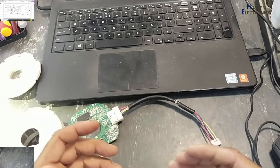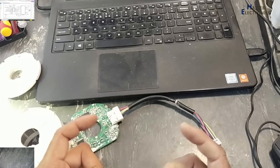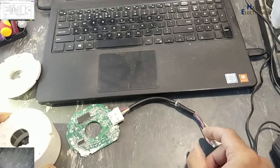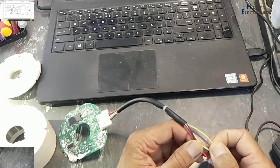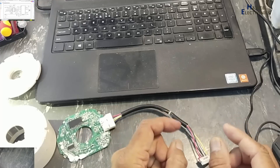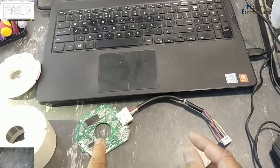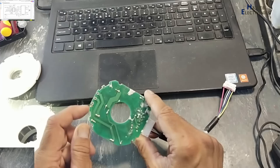This circuit receives 310 volt DC. When we say DC motor, a DC motor always needs carbon brushes and slip rings to flow DC current. But here we are providing 310 volt DC, and then there is a control signal that is just 5 volt. Based on that signal it will create the drive and adjust the speed of this motor by controlling the duty of this three-phase signal.